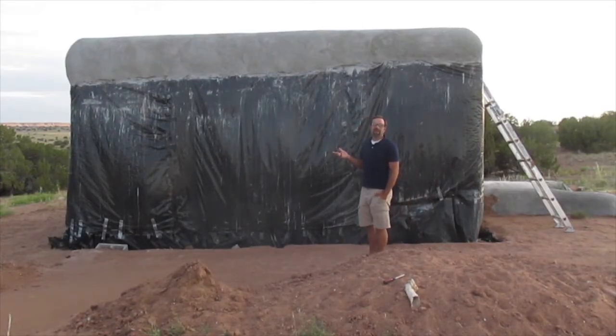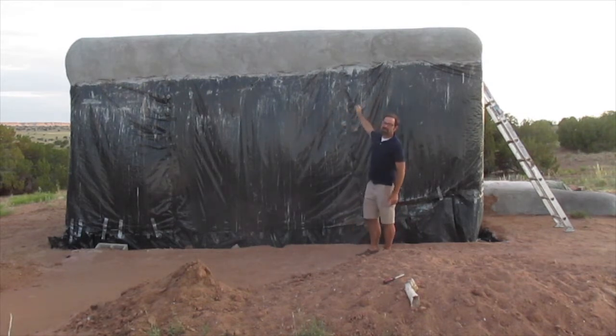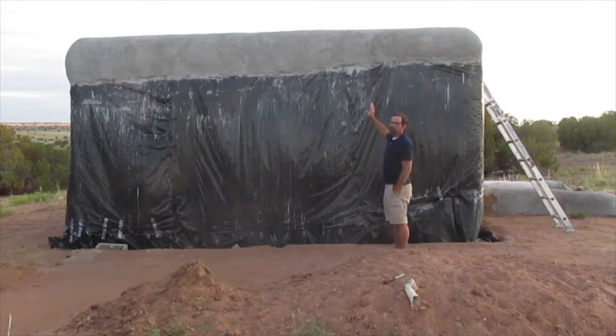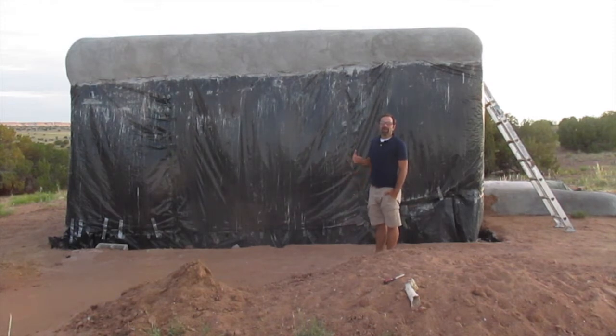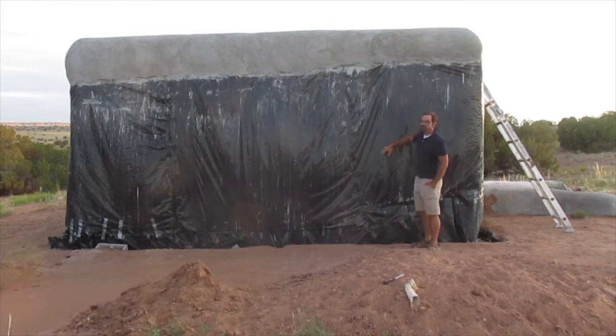One of the things I had to do to get the roof ready was to extend the wall to its final height. I had left the wall short on purpose last fall because I didn't want the top of the building to turn into a swimming pool when it rains. The wall was short, even with the top of the roof, and you can see the roof line here at the bottom of this new construction. There's a tarp over the roof and walls so any rain would just flow over the sides. Now the wall is extended all the way up — thanks to Nancy and Jeremiah for their help. They came out and helped me get all the cob on, which was time sensitive because the cob will wash off in the rain. Now that the top is finished I can just flip these tarps up, do the cob underneath and the stucco, and if it rains I can fold them back down again.